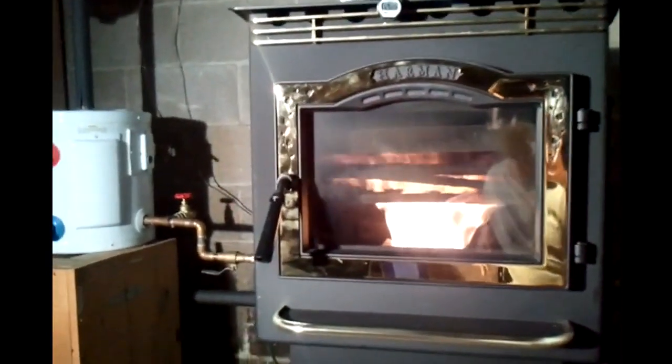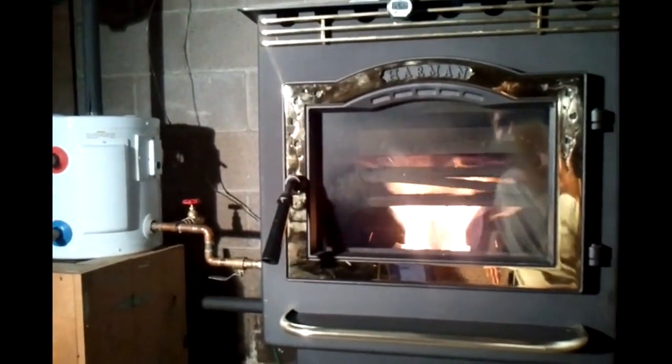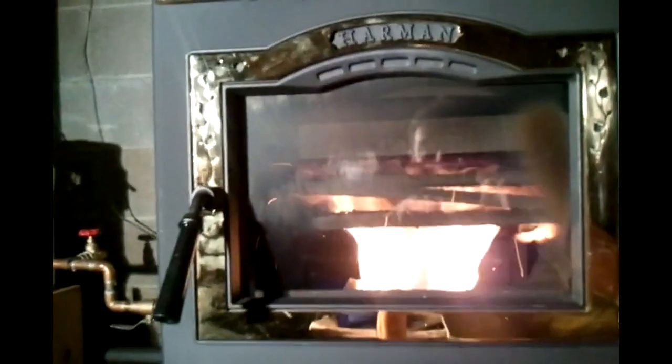People ask: how can you heat more square feet with the same amount of fuel, or three times the square feet plus domestic hot water with only 30% more fuel? I'm not a heating expert, but the best I can explain is that we're capturing more heat from the single heat source — collecting more BTUs through the mixing plate and coil. I have a thermometer probe in the exhaust pipe showing about 300 degrees right now, which would typically be much higher — a good indication that I'm losing less heat out the exhaust and that heat is being used to heat the house.